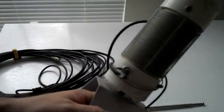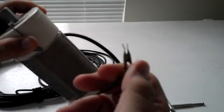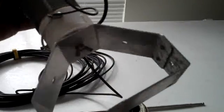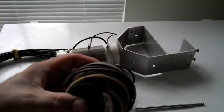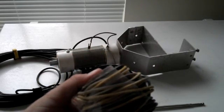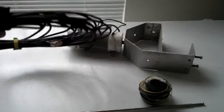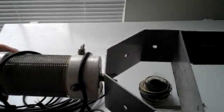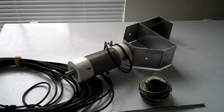The lighting's bad, but I'm gonna have to sand all these down to get better contact. This one is definitely a short that needs to be replaced — it's rusted shut where it used to go on for the coil taps. I'll need to clean the whole thing up. It's got a full wave for 40 meters of wire, but it's all UV damaged now — it was originally all black. I also need to replace the coax because it looks green, meaning water probably got in. I'll cut it off and redo it with liquid electrical tape to reseal it.